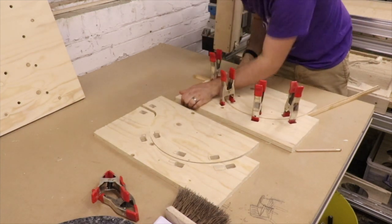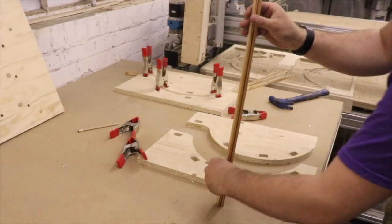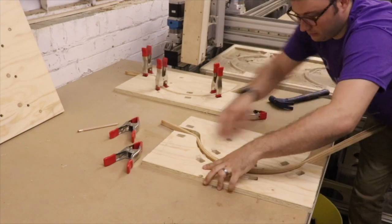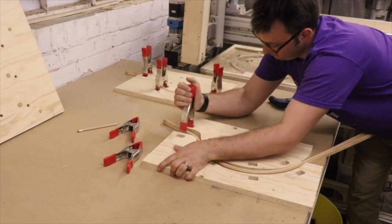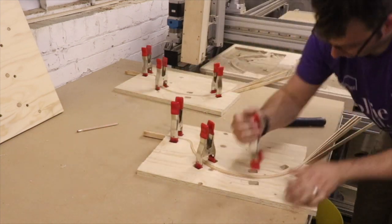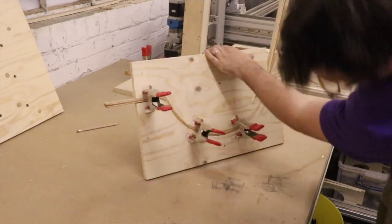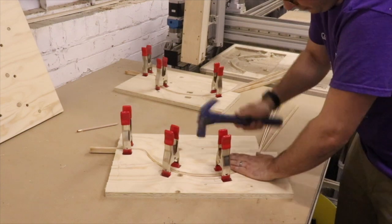A couple of holes either side and then basically clamp them together to leave them to dry — and it did the trick. For this second one I had the process dialed a little bit more: pop it straight in the middle and use a combination of spring clamps and a hammer to persuade it into place, making sure those two formers are as tight as possible. This was really good fun — I love the batch production aspect because I was making six moulds worth, so it's really exciting seeing multiple parts coming together for these lights.